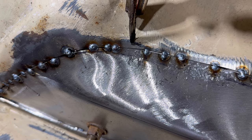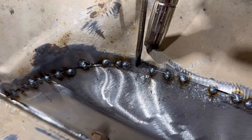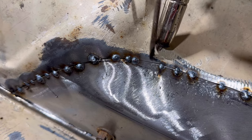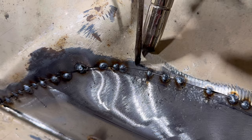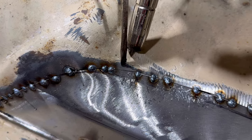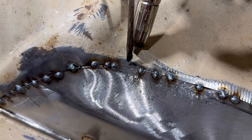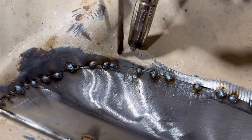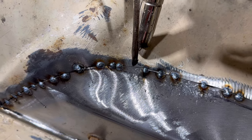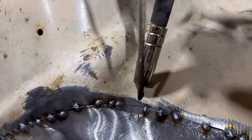But when it comes to grinding it, to get that to look flush like this one here, you're gonna have basically an edge of weld where it's gonna look like all skew width. And that is fine, but to make things really nice and easier for the painter, do it flush like that. If there's an edge on it, that's fine, it's just a skim of filler over it, but what I try to do is make it flush, seamless like that. Less filler, less work.